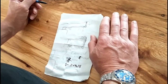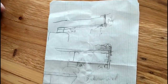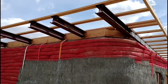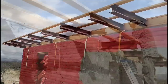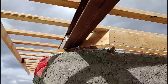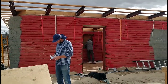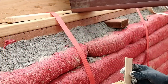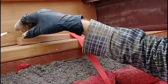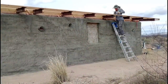After a lot of consideration, we decided to go ahead and box in the eaves on this house, so we had to figure out exactly how to do that. I'm drawing it out trying to figure out the best way to fully box in the eaves to create that soffit and fascia using the least amount of material in the most efficient way. Before we box in the eaves, we want to make sure everything is sealed up good for the roof. Kyle spent a lot of time sealing up all around the beams — between the beams and those block boards — to make sure that roof cavity is completely sealed. He also tightened up the straps that hold down the roof to the walls by putting wedges underneath to create tension, since the straps we used didn't have ratchets.